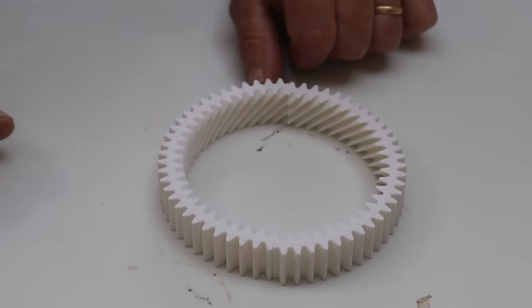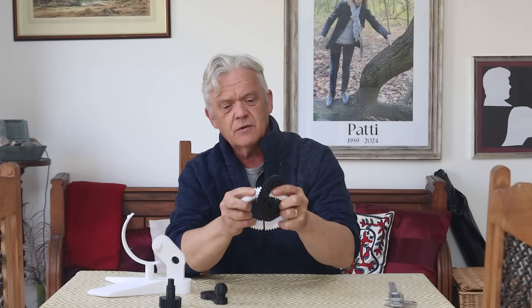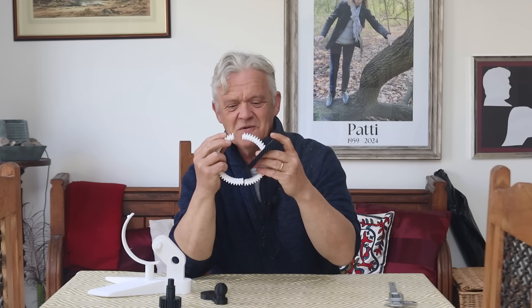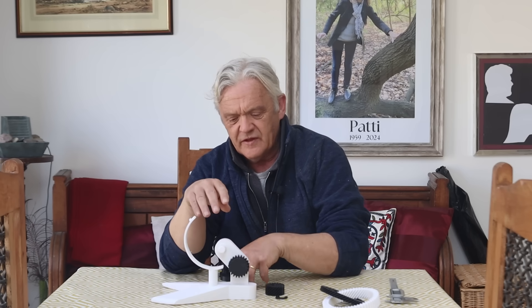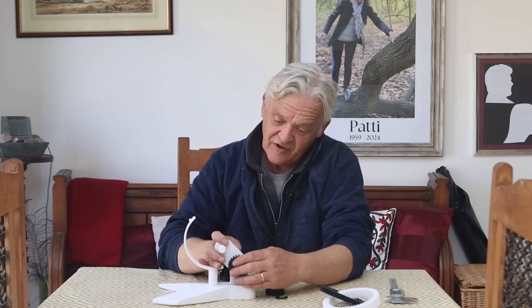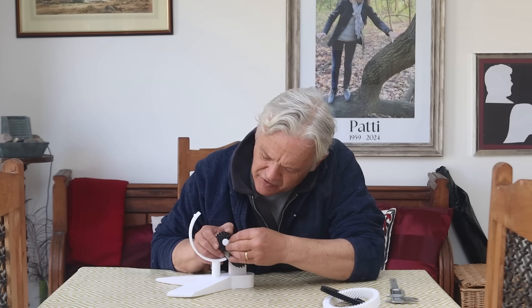The ring is one whole piece in the file but I split it in the slicer - I'm using an OrcaSlicer variant - and added little pegs to join it back together, because it does need to be able to split. It has to fit through the frame. The version with a herringbone gear around the outside goes on like that and gets glued together. On the frame there's a normal spur gear with a little indentation and a square end; a clip fits on the end to hold it to the frame. There's a handle with a square hole that goes on, because that's the bit we're going to turn. Then there's the helical gear, which goes on that peg, and a clip holds it in place.